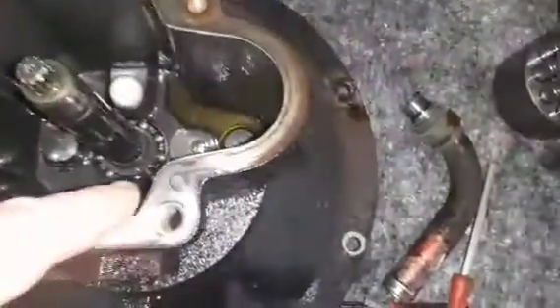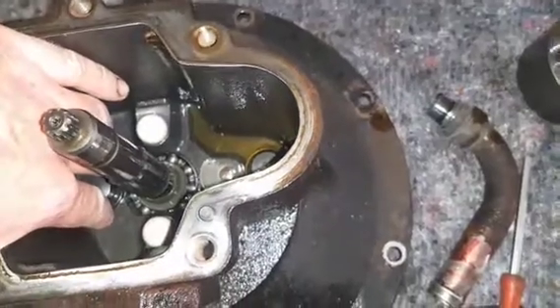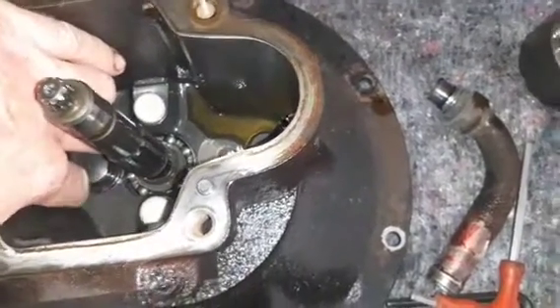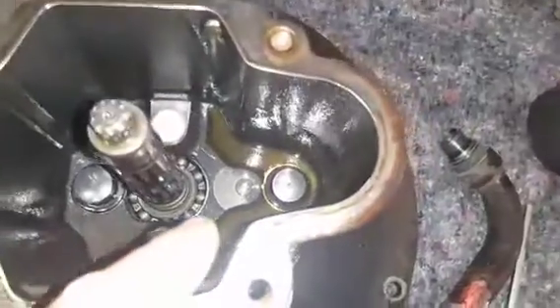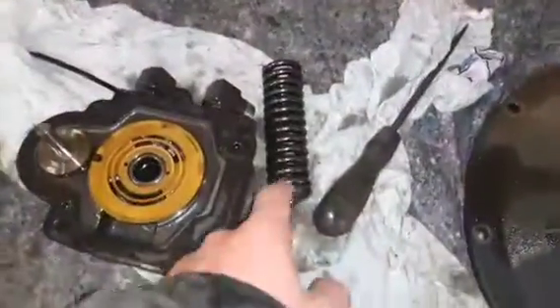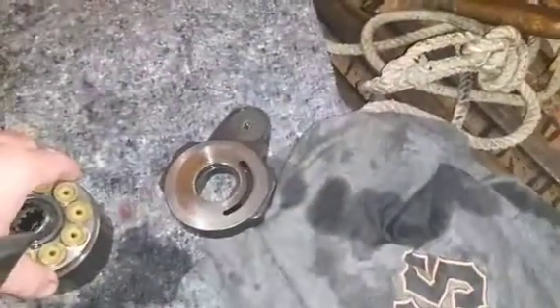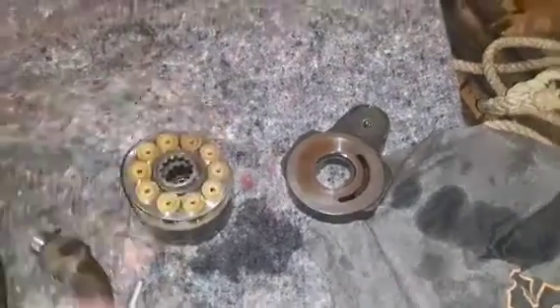We'll put the light on for you. Inside here you have two plungers which I'm guessing are hydraulically operated. We'll take them out and have a closer inspection. They make this move — this bit here — and then the spring goes in there, and then you've got the spring, then you've got this which is your adjuster, then you've got your pump. What this does is it alters this angle pivot here to determine how much you're pushing and how much you're pumping.